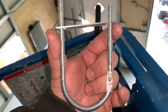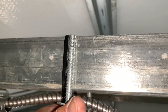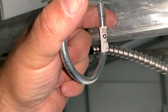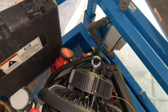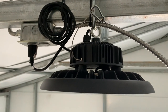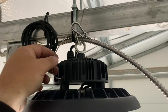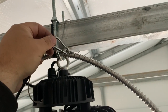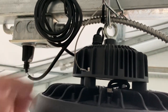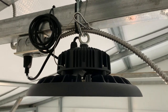So to hang these lights, I've decided to use U-bolts. They're going to go right around this tube up here, and there's a bar that goes on top of our rafter. We put some nuts on it, and it'll leave a nice U-shaped space because these lights have I-bolts on them. The I-bolt will slide right around this hook and be suspended nice and sturdy. So our first light is complete. We ran our wire, mounted our outlet, and suspended these U-bolts. We've wrapped the safety cord around our rafter and onto itself. I've zip-tied the excess cord up here so it's not hanging and not touching the heat sink on the light. That's pretty much the process - I've got four more of these to do.